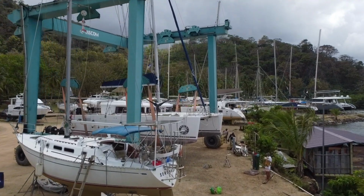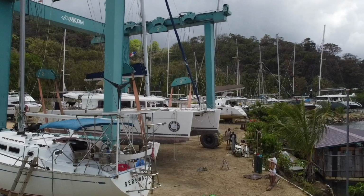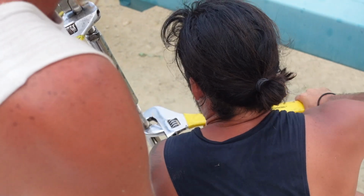Okay, now we got 5200 under here. When we let the strops down, that'll just close up and glue that together. Now we're going to loosen the shrouds. So we're going to undo the turnbuckle so that the shrouds are pretty much loose, so that when Jim lowers us down, the boat will just start to straighten. That's the plan. Let's see if it works.